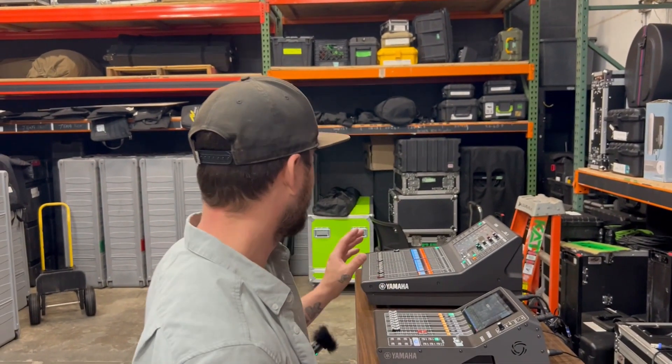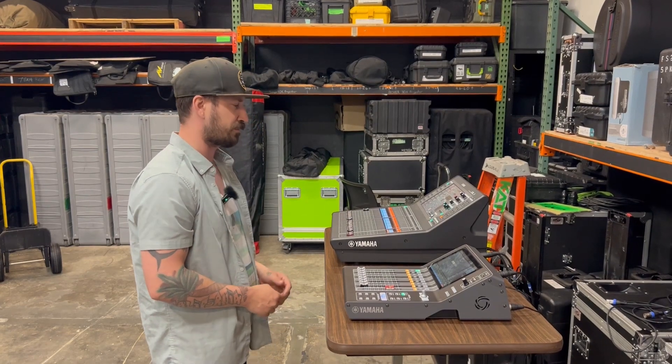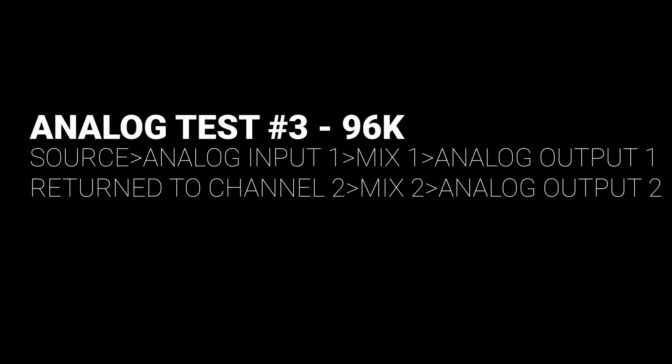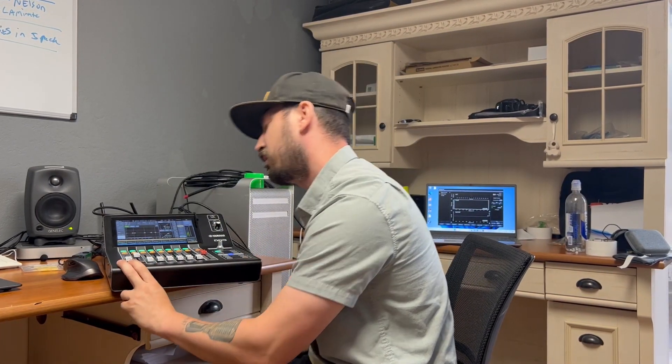The result is extremely less than I thought the DM3 would do, and compared to the Q01 it makes sense — you may have this in a studio and be using it for USB I/O, whereas the Q01 is simply for broadcast and live sound reinforcement. Also, the ability to have the DM3 run at 96k is pretty cool. For this next test we are going to do a return on a channel. What we're doing is taking an analog signal in on input one, routing that to a mix, sending that mix out of the console, returning it to a different channel on the console, and routing that out of an Omni to a destination. This lets us handle a group return — maybe going into outboard gear or something like that.